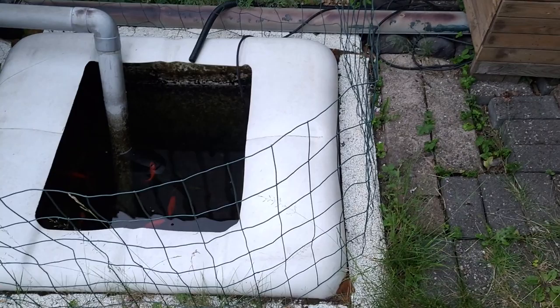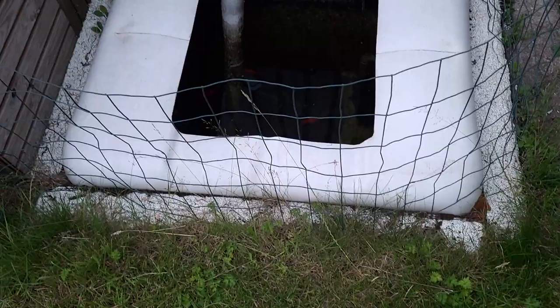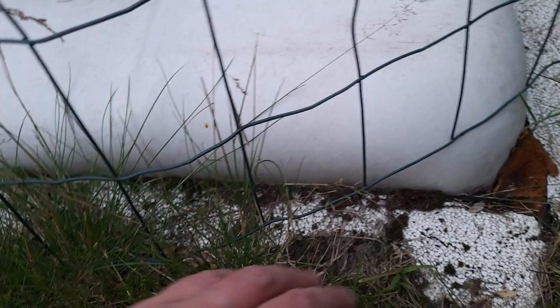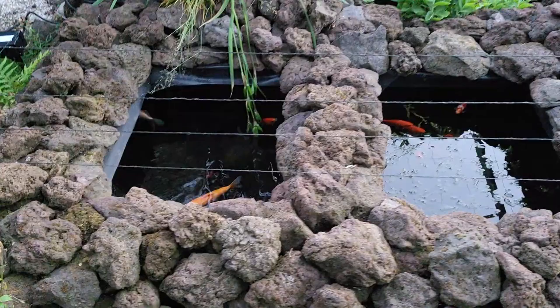What's important to mention: if you bury a tank without foam, the walls will collapse — the pressure of the sand is too much for an IBC container. So I thought, what if I spread the weight? I bought used foam, buried it all the way a meter deep on four sides, connected together with perf foam and some steel rods to make it more solid. It's been like this for four or five — maybe six — years and it holds perfectly. No problem with collapsing walls.